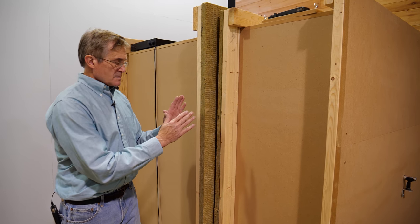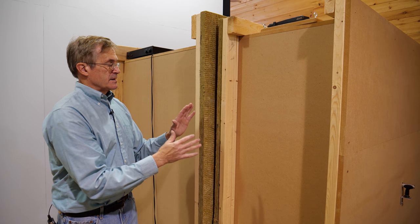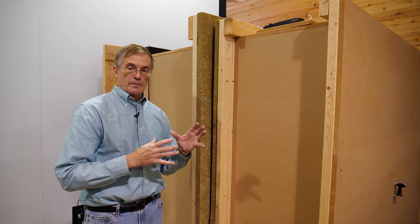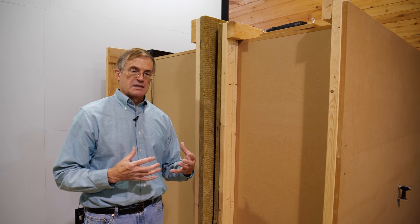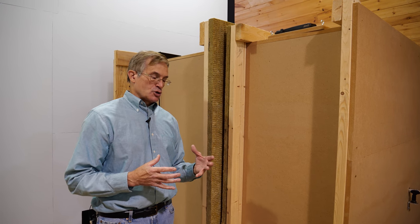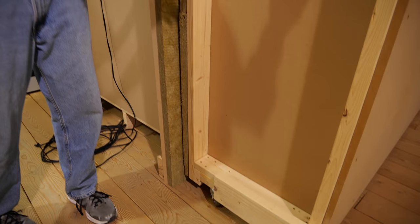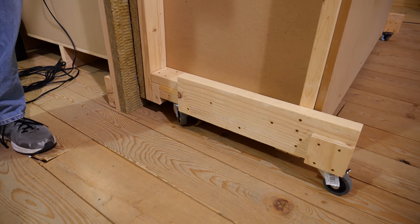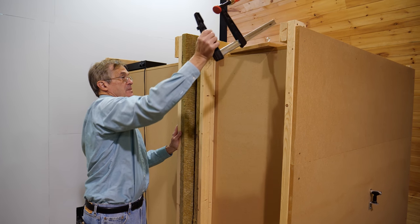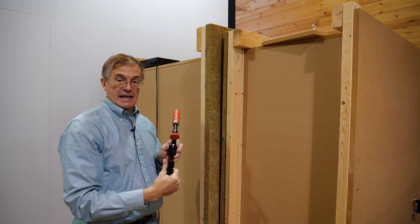You'll notice this has been constructed in sort of a clamshell — two unequal halves. The reason is that this entire system weighs about one ton, and because it's so heavy, even a door with all the padding would need really robust hinges to open and close. An easier solution was to build a static half and a somewhat smaller half on rollers. Once we close it and bring them into approximate alignment, I simply take some heavy duty clamps and squeeze everything together, locking the two pads and providing a nice stable seal.